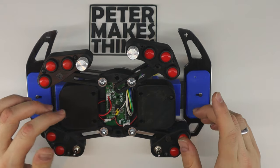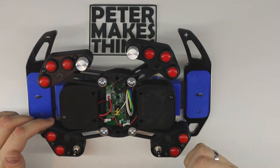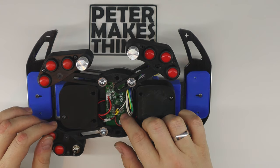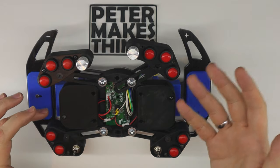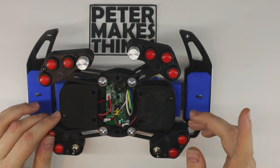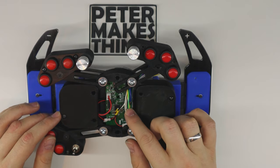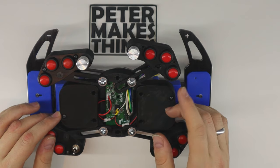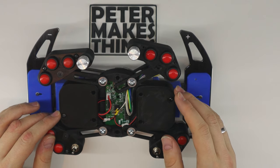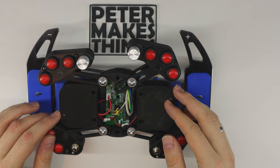You might notice that at the moment I only have one of these arms wired, and that is because I'm working on some other designs as well and I'll have to remove the BlueHID board anyway. I would also strongly recommend soldering directly to the board some good quality silicone wires rather than using these cheap plastic ones, which are meant for prototyping rather than long-term use — it will be more convenient and much more durable.